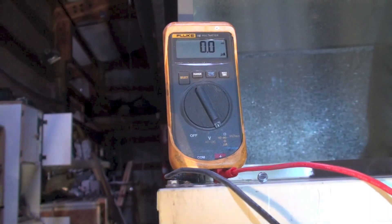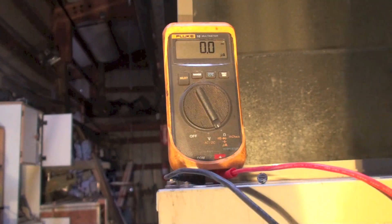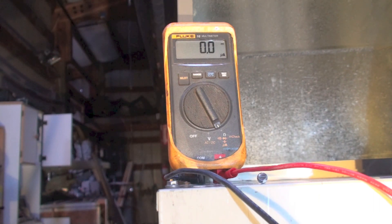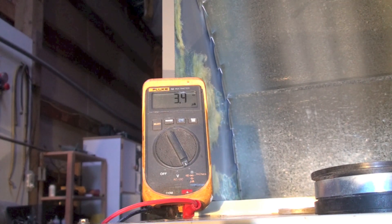You can see I've got the meter set up there, and I'm going to go ahead and start the furnace. This should read somewhere from two to three and a half, maybe four, something like that when the burner lights. The hot surface igniter has to come on first. You can see it's come up to normal — flame rod is good.